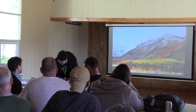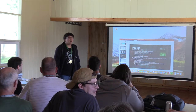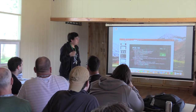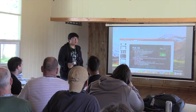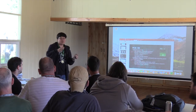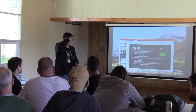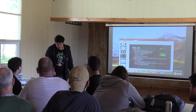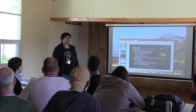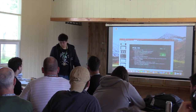So actually, let's go back to that sentence. How do you laminate a 40-layer board? The cool thing was I got to talk with a lot of those field applications engineers and salespeople. It's funny how they assemble those 40-layer boards. They'll do it in a vacuum, put down the epoxy and build it up layer by layer. The interesting part, I learned, is there's no warranty for that sort of thing. So if one of your boards is dead on arrival, you're out like 10 or 8 grand at that point.